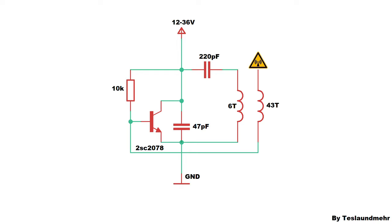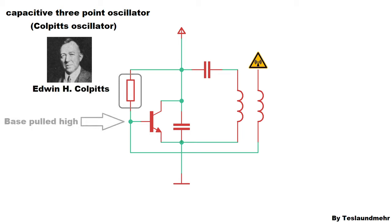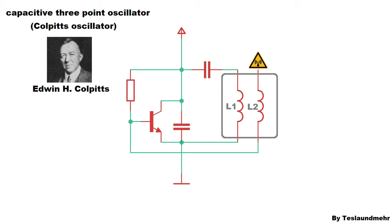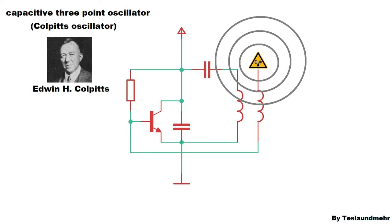I'm pretty sure this schematic was used — most of you have already seen it on my channel. It's quite simple. This circuit is called a capacitive three-point oscillator, or Colpitts oscillator. The 10k ohm resistor pulls the base of the transistor high, which causes the circuit to start oscillating. C1 and C2 in combination with L1 create an oscillating circuit. L1 is inductively coupled with L2, and energy is inductively pumped from L1 into L2. A feedback signal is fed back into the base of the transistor via the bottom of L2. Through resonance transformation, a high potential builds up at the top of L2, and a strong electric as well as magnetic field is emitted. It's really amusing how many people think this circuit is fake — yes, there's an incredible amount of nonsense on YouTube, but this circuit is definitely not part of it.